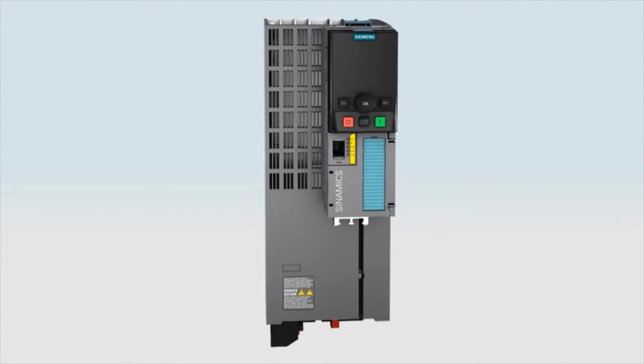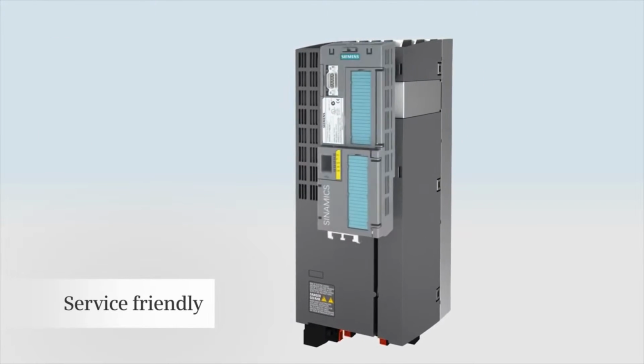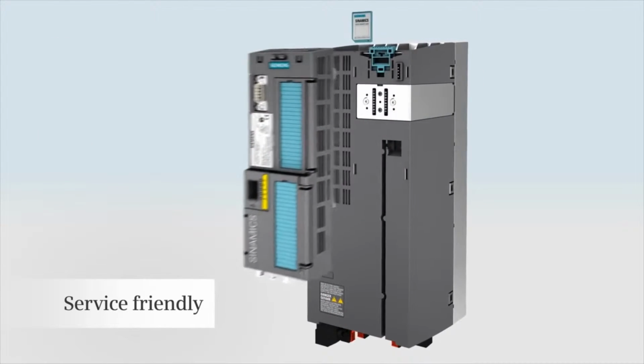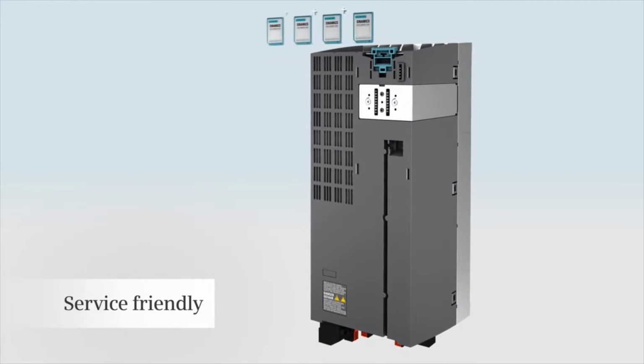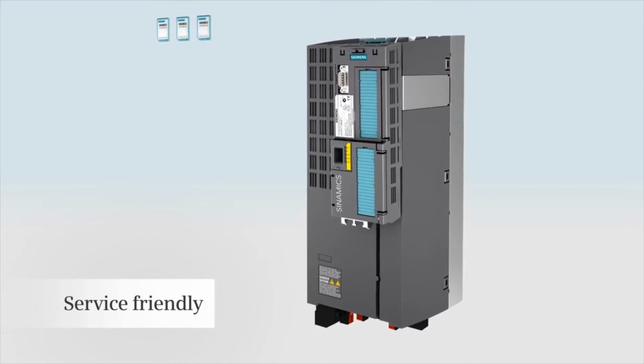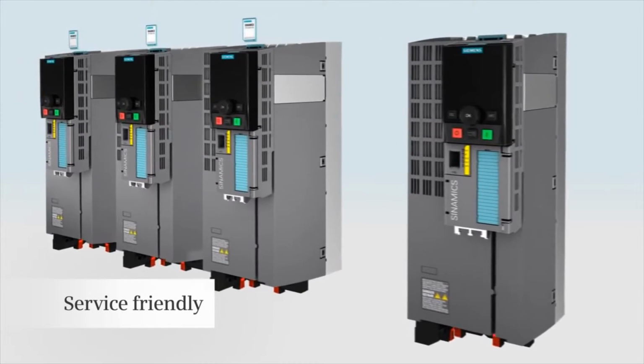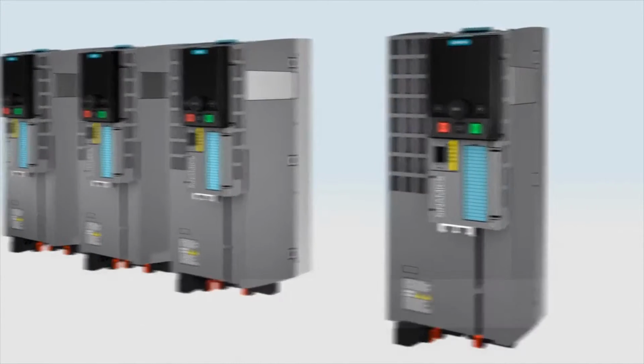Furthermore, this makes SINAMICS G120 service-friendly. If a part fails, then it can be simply replaced as a result of the modular design. The control unit can even be replaced under voltage without having to be reconfigured. And more precisely, by copying the parameters using the SD card. This reduces plant or system downtimes.